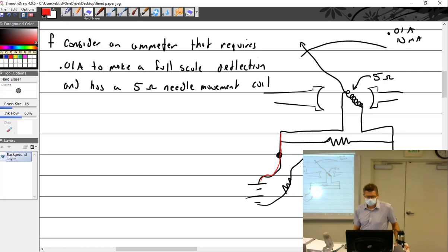We're going to get rid of this for the minute. Not worry about that. Back to here. So I'm going to have 10 milliamps run up through here, go through here. What happens when it goes to that coil? What does it become? It's a magnet. A magnet, okay, so it's going to come back out and around. So we're made of magnet, and these are magnets as well, north, south. And so we'll say that this becomes the north and this becomes the south, and they're going to repel each other and move the needle that way.